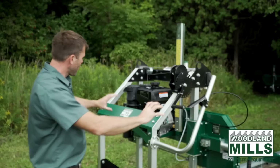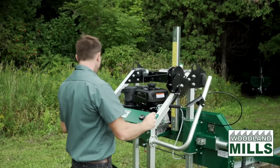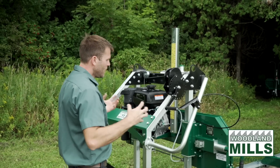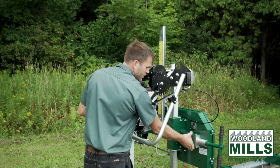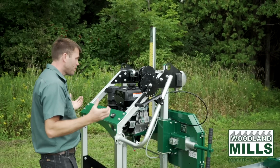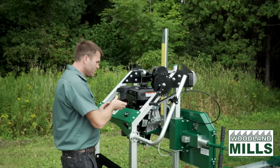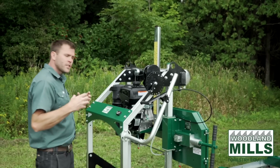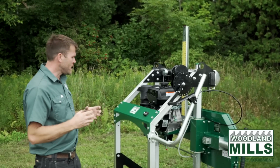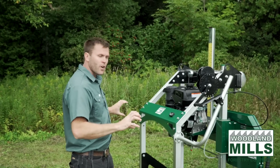We've got all those components, the engine mount, the new RapidChange, and the left side tracking has all been bolted to our rectangular welded steel head assembly. So we use a rectangular steel tube, it's all welded, the engine mount's all welded in, and that gives us the rigidity and the strength needed by having that tube all put together as a solid structure.